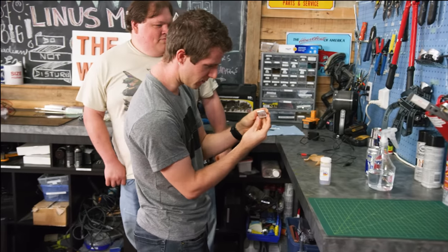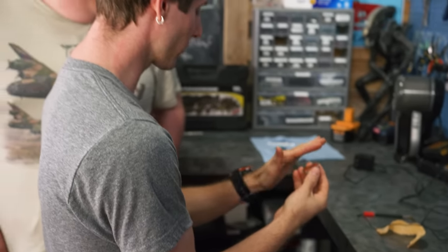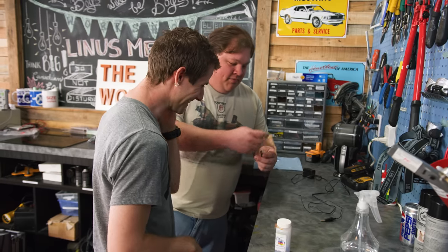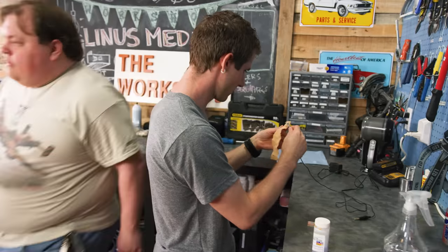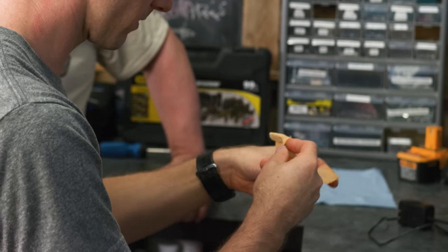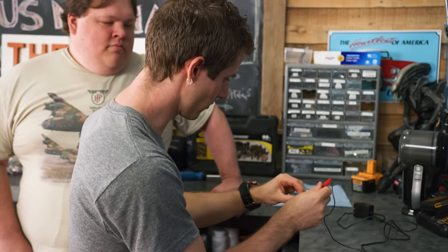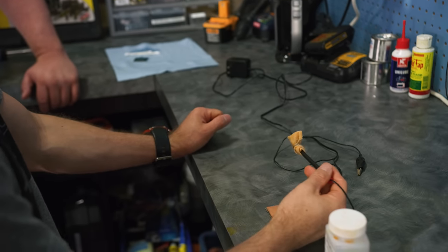So this is our lapped heat spreader. Got that exposed copper going on there. I guess the smoother this is to start with, the less gold we would have to waste applying it thicker and then polishing it down, right? Right. What we need to do is wrap this around like this so that there's no metal showing. That's to absorb the liquid. None can be exposed, but don't do it too tightly, because the fluid needs to be able to flow with the electricity. So this hook is just gonna hold our piece then? No. We're gonna brush it on. We brush it on? Yeah.